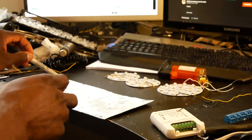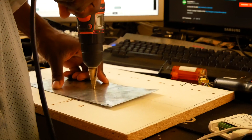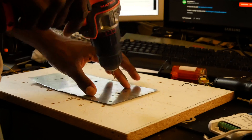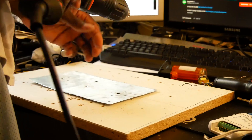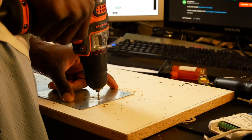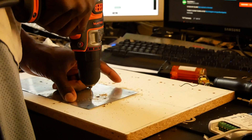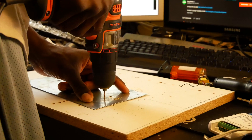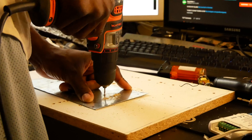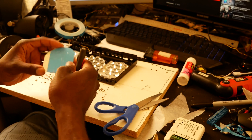The aluminum sheet I used is basically the same thin sheet aluminum used to build the entire housing. I cut it to size — it kind of reminds me of the black box LEDs with what some call a license plate cutout for the cooling panel. I also added some 10mm x 10mm heat sinks from the old build onto the back, which increases the surface area so the fan can cool more efficiently. In this clip you can see me drilling holes in the aluminum panel that line up with the LED arrays so the wires can pass through and make close contact for heat transfer.